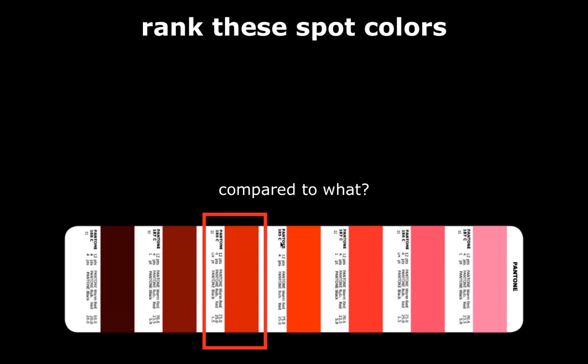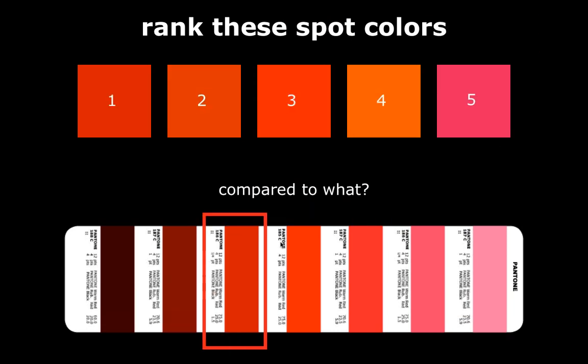And let me just put them in order to make this make a little bit more sense. It's been tested many times how people want to quantify these, or what numerical systems provide the best estimate of color proximity or color difference, and the answer is Delta E. Now there's a few different types of Delta E, and the best one, if we get really into the weeds, is the most recent. That's Delta E 2000. But right now, I'm just going to limit it at straight Delta E.